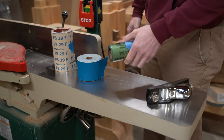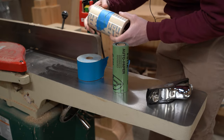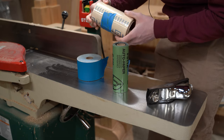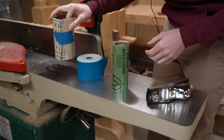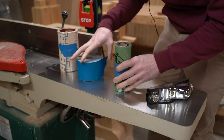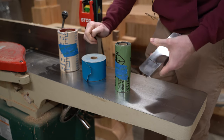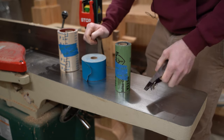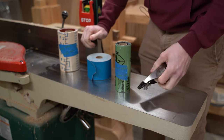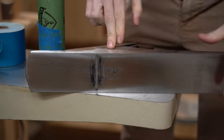The tools you will need are something flat to work on, PSA sticky-back sandpaper — a coarser grit to remove material faster; I'd recommend 120 — and also some finer 220. You can go higher than that, and I eventually plan to when I get my granite surface plate, but this will definitely get you a good working plane.